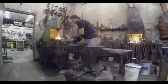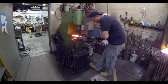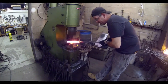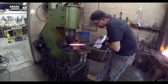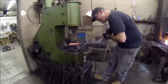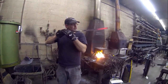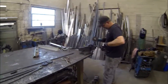Back into the furnace one more time. Jason makes it look easy, but this entire process took quite a bit of time — there's real art to it. Once again drawing the material out; he wants to end up with a long, flat piece of steel that can be easily folded. Another way of making the layers is to actually cut that piece. After the material is drawn out to the desired size and shape, he can grind it in half and then stack it — just another way of doing it.